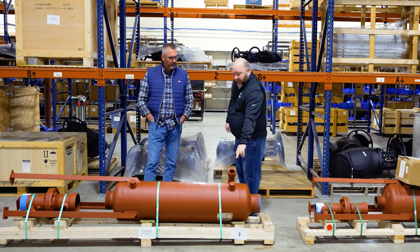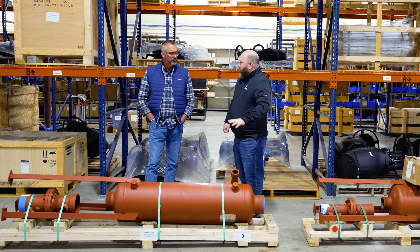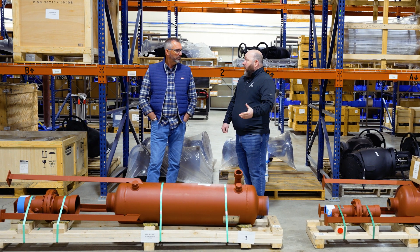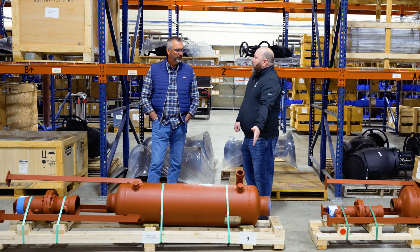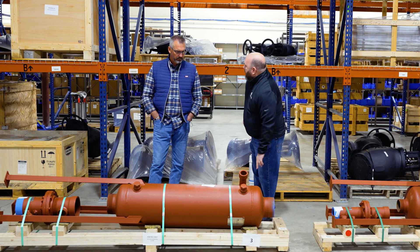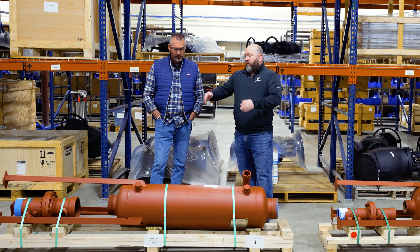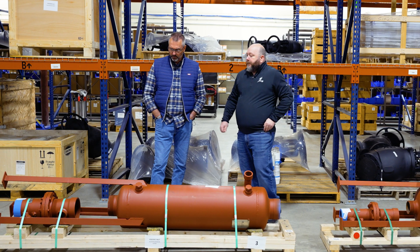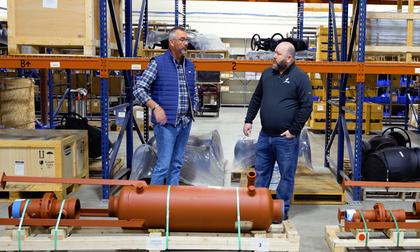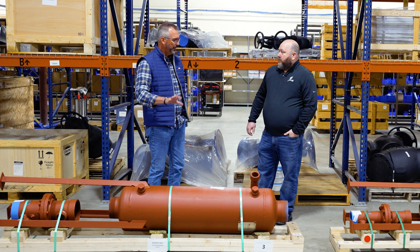You've got different inlets based on the bottom of your boiler. You don't restrict blowdown — you're not allowed to restrict the flow of that blowdown in any way, shape, or form. So you've got to be able to run that full size. That's one of the selection criteria for which separator you have. And then you have different sizes for the vent and different sizes for the drain. Just depending on the amount of flow from a boiler is how you're actually sizing the tanks.